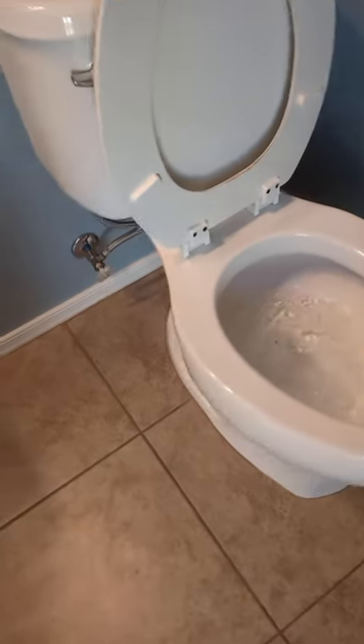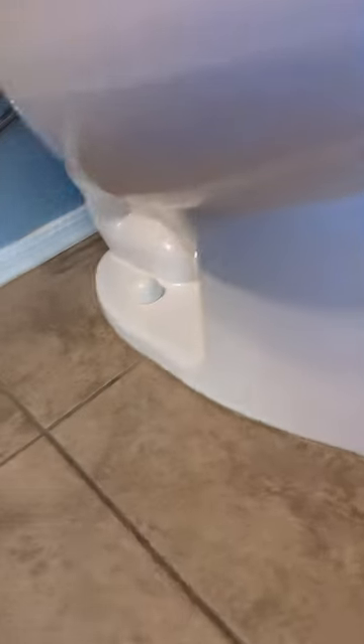Test the fan — that one's working. Check the toilet by giving it a little wiggle. This one is only a tiny bit loose, so I wouldn't say anything about that. Then I straddled the toilet and rocked back and forth to see if it moves — this one does not. Give it a flush. It flushes good. You've got your caps and it looks like it's caulked, so that's good to go.